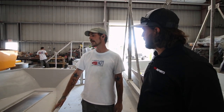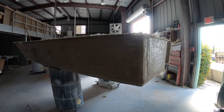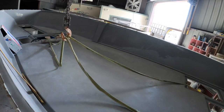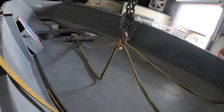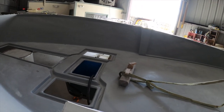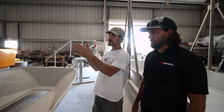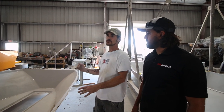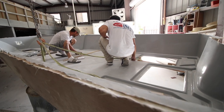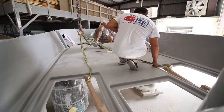Like a standard liner, we would put it up on barrels after we test fit it, because when I test fit it, I climb in all the holes and I scribe out where the stringers and bulkheads actually touch. So that lets me know positioning of your forward rigging tube, because I have to do it by measurement. All the liners fit a little bit different, so I can't just do a generic measurement off of the bow or the stern. So I have to put it in, measure it, get my total length for your forward rigging tube, and then cut it.